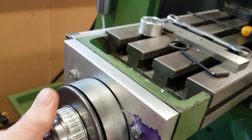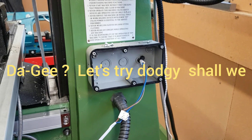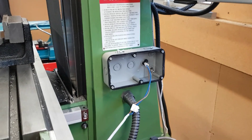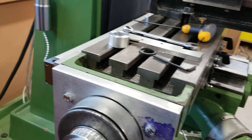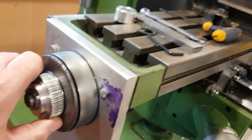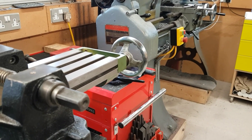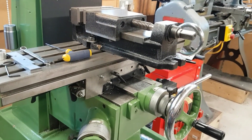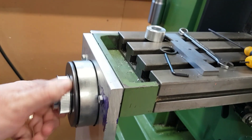What I've had to do is connect that with a rather dodgy cable into my permanent power supply. If you've watched previous videos, you know that inside of the column there's a 12 volt 30 amp stepped power supply in there, which was put in specifically for this reason. If we roll back around, that's turning nice and free, and if I turn on the power supply - now we have lights - and you'll notice that if I turn the opposite side, we've actually got rotation. It does hold good. Obviously I'm rotating this end by hand and I've got enough force on there, but I'm not completely happy with the loading. If I turn it off you'll find that it spins free.